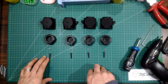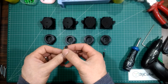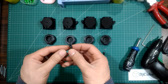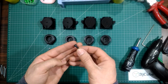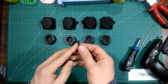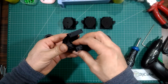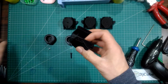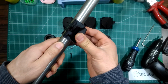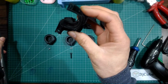First, I want to mention some point here. As for the type of the bolt head, when I bought the bolts, I didn't really care about it. But in this particular piece, the bolt's head must be some concave or conical type, not this flat type. As you can see here, this flat head is obstructing the tube stability in place. So it is really higher than it should be.